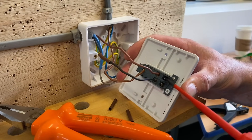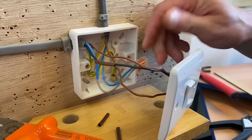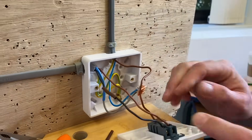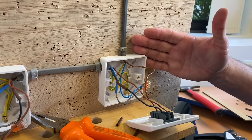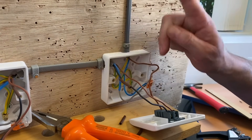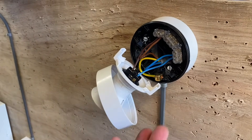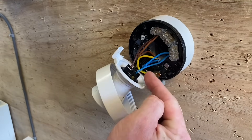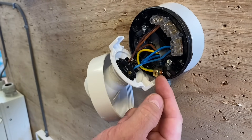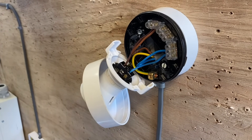We've identified all our conductors and that's our two-way switch finished. There's our neutral going up, so we've got our switch line, neutral and CPC making their way up to the light point. That's how to connect the switches when wiring through the switch. At the baton lamp holder - which could also be downlights - we've got our neutral connection, our switching line connection and our CPC connected in the back. We're all now connected up with this different wiring system for two-way and intermediate switching.